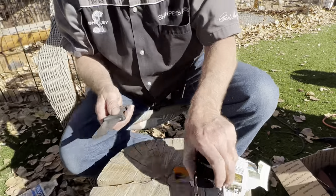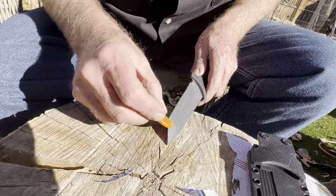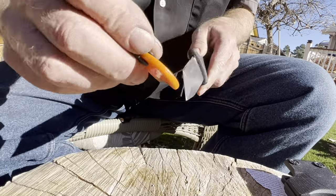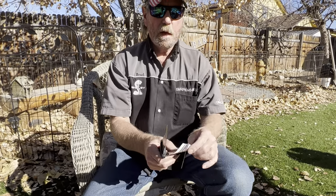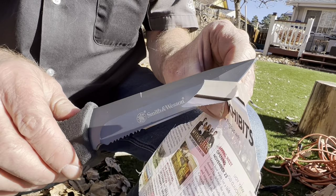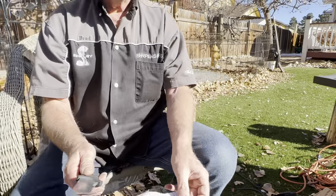There's a little bit of a burr on it. So we touch it pretty light on that side, then turn it over — flip it a few times to polish the blade and get rid of the wire edge. If you're going to cut meat, sticks, or rough materials, you don't have to really worry about the little wire edge because it'll come off as you cut. But if you're going to slice paper, you have to get that little burr off — even though it's microscopic, it's going to interfere.